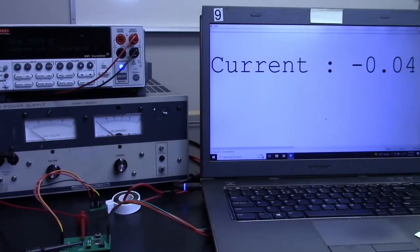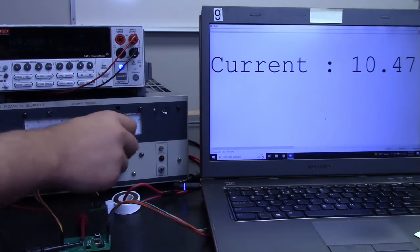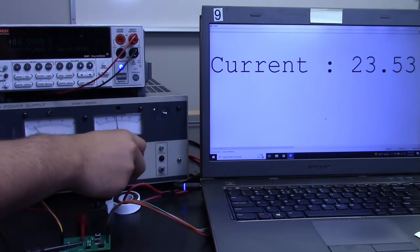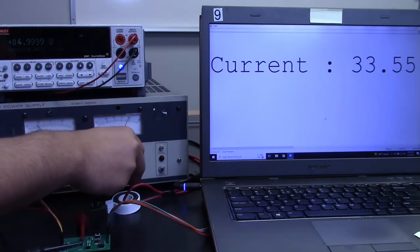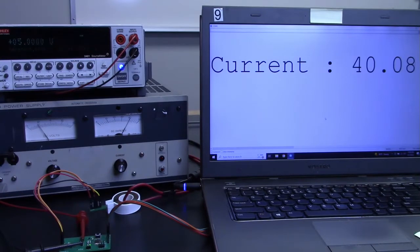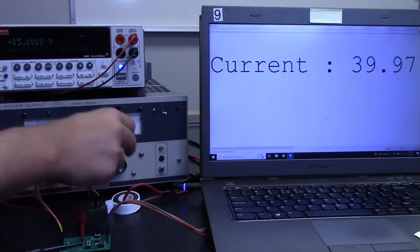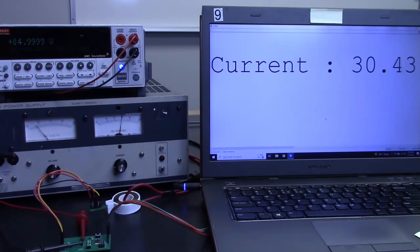In this demonstration, we are using the ALTO25 with an amorphous iron core material to sense 0–50A DC current. Using a simple piecewise calibration, we were able to achieve an accuracy of ±250mA, an error of only one half of a percent over full scale.